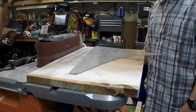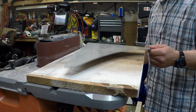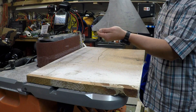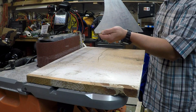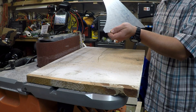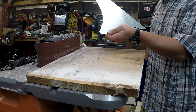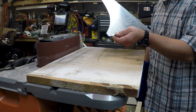Today I'm working on cutting out the remainder of my 63-thousandths thick gussets and materials. This is the side skin gusset for the fuselage. It's been rough cut, and on my blog I mentioned that I did most of this with a saber saw because it was easier to cut out the very small nested pieces rather than using the electric shears. Then I did some finish cutting on the bandsaw to get it as close to the line as I can, but there's still quite a bit of sanding left to do.